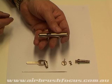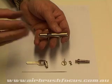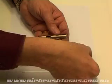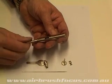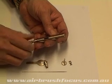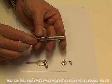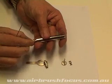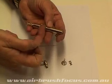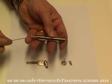Now, in pressing it in, I may have over-tensioned it. I may have pressed it up against that ring, those nodules that I showed you earlier, a little too hard. And we'll know in a moment. What I do is I put the rear spring assembly back in again as a guide for the needle. So that's all wound in. And I just undo the needle chuck again. And again, you'll note that I have the air valve coming down the middle of my 4 fingers so that I can span this finger out and guide the needle in.